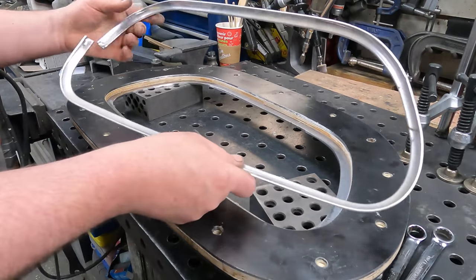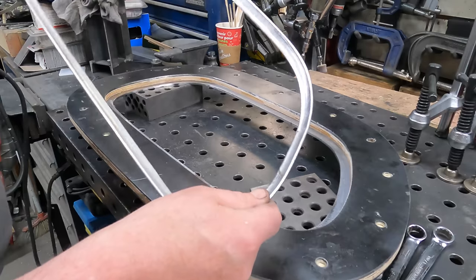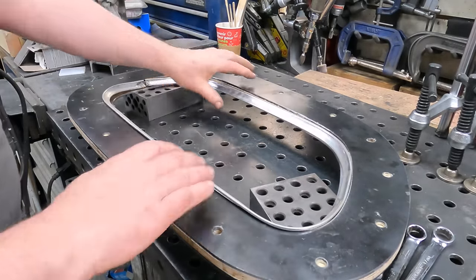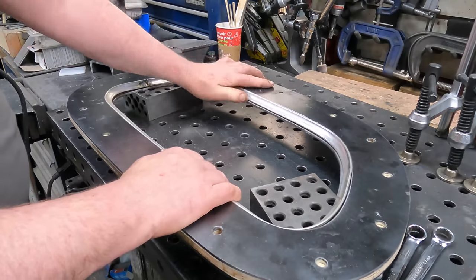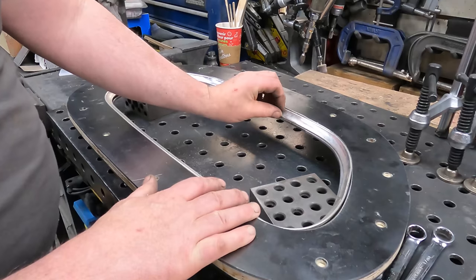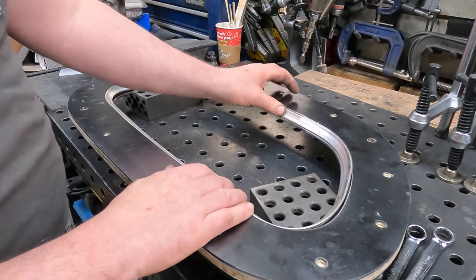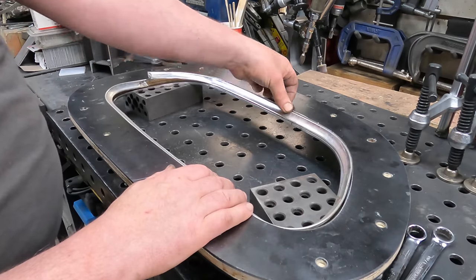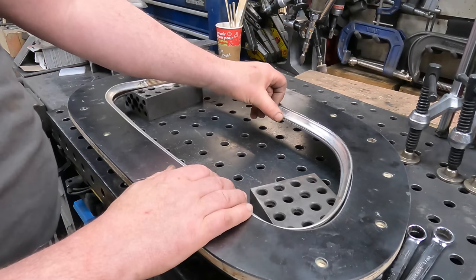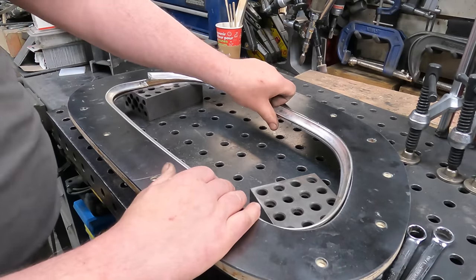This is the trim that we're trying to make. It's just about impossible to make. Like, once again, mine's damaged and you can't find better ones anywhere. And you can see now, I hope, the idea is starting to come a little bit clearer. I'm making this a little bigger, but not appreciably. Anyway, we're going to have a corner here, then the cove, which we'll make out of Bondo, and then this other flange is going to go down. Okay, so it's going to be hammered down.